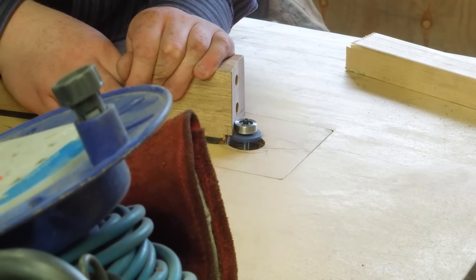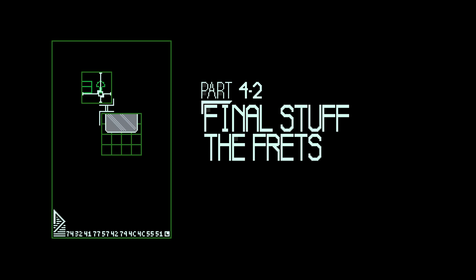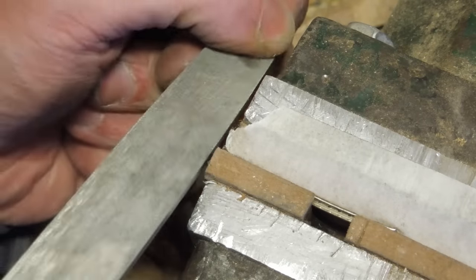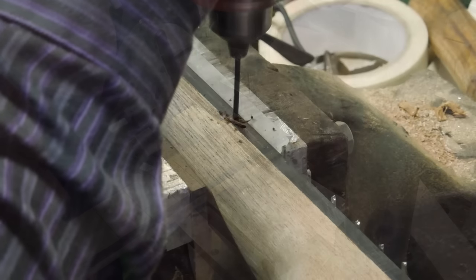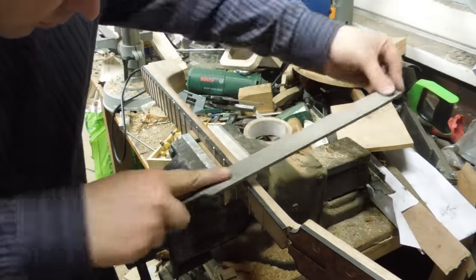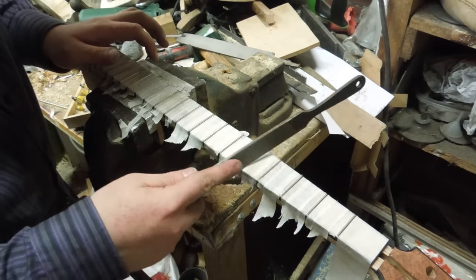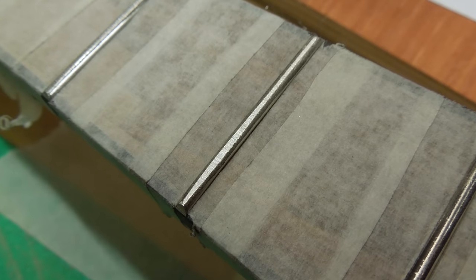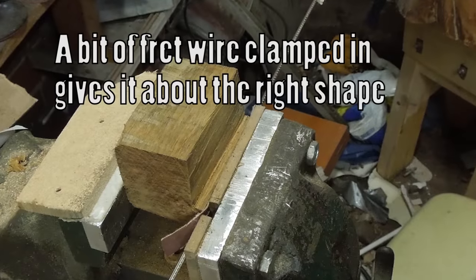A bit of the neck was cut away to accommodate the tension hoop. I start by putting an ever so slight chamfer on the edges of the fret slots. To remove the tang where the frets overhang the edge banding I just use a file. I used the drill press to push the frets in. I also figured it would be difficult to find the 12th fret if I didn't put some side dots in. I filed the excess frets down but got a bit carried away and put some gouges into the edge banding, then sanded the frets flat — I don't think it's necessary to get it absolutely perfect; by the end of the day it's wood and not that accurate. To put the round top back onto the frets I made a block of wood with a groove in it that I glued sandpaper into.